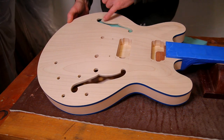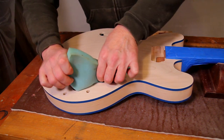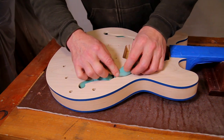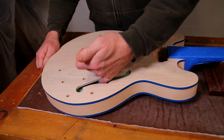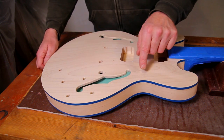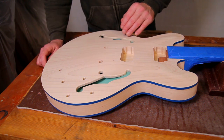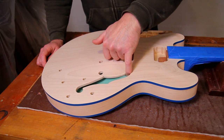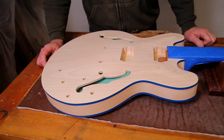So I've done the top one and I'll just get a bit of foam into the other one — it's simply just a case of cramming it in. It might not be a perfect fit and there's a bit of a gap, but it will stop the bulk of the finish going in there and will definitely stop it spraying onto the back of the guitar. Once this is properly dried, I'll just pull that out — you might have to cut it away from the edges a little bit, but more often than not it just pulls out without a problem.